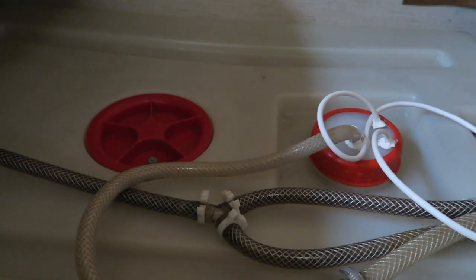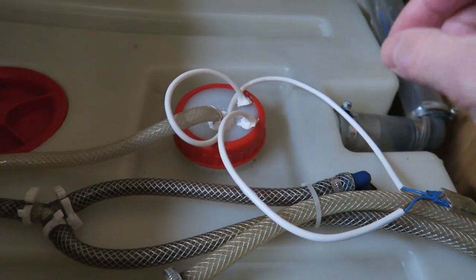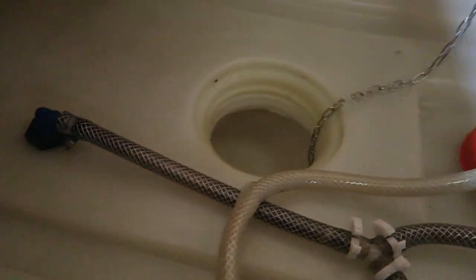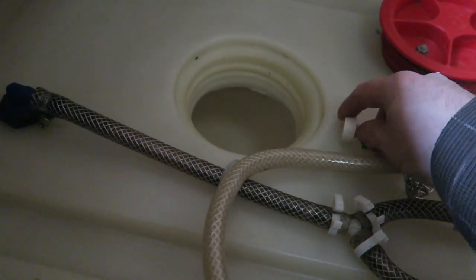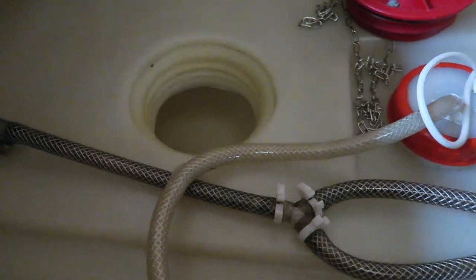The tank's in pretty good condition. There's a slight bevel just in the middle, but apart from that it's actually in great nick. We use this for all our water, obviously drinking water as well — we just make sure we clean it really well. When it's not in use, it's emptied. You need to keep it empty — that is the secret. You can see there's a chain to replace the original one which was rusty. At the end of that chain there is a little plug that sits on a tiny hole, and when you pull that plug it empties the tank. It's as simple as that — just a plug on a chain. Nothing to go wrong with that.